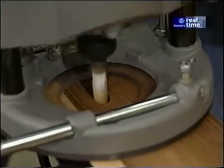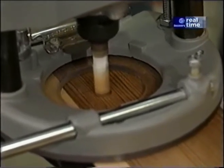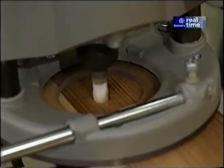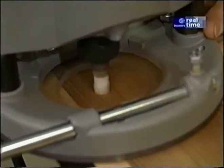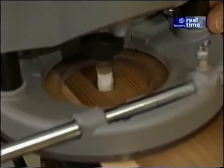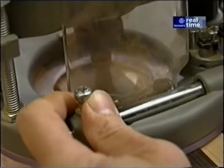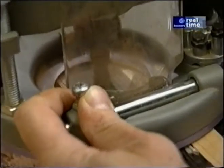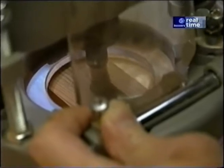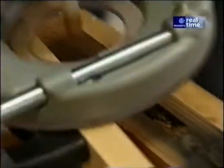I've laid out the rails for a series of mortises, which receive tenons on the ends of the slats that go across the chaise. I'm using my router set up with a guide fence and a half-inch straight cutting bit. I simply plunge the router in at the beginning of the layout and remove it at the end. Next, I have to make two mortises in the bottom of the rail, one on each end, to receive the legs. I've reset the fence and made a plunge cut from each face, half the depth, then completed it by going the rest of the way.